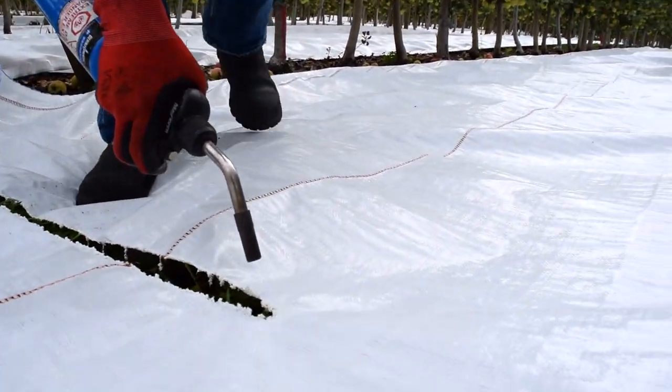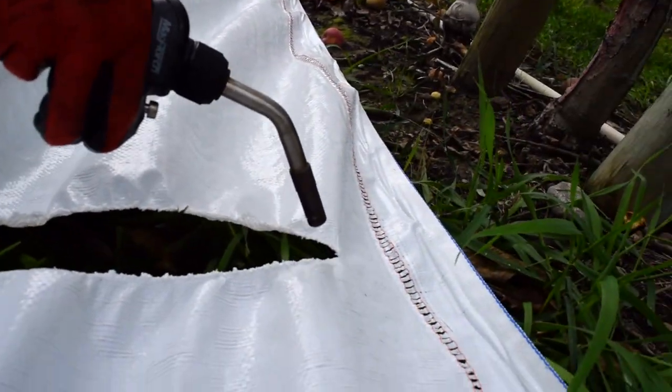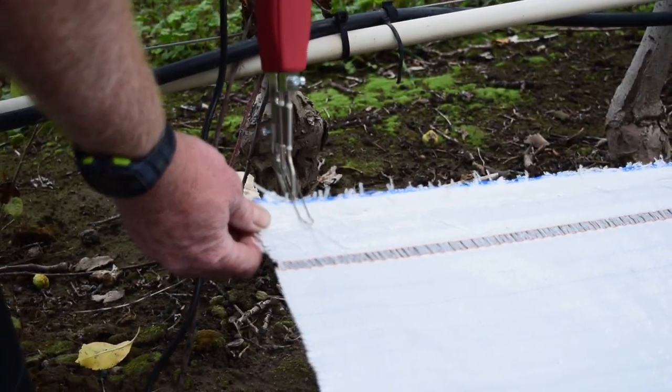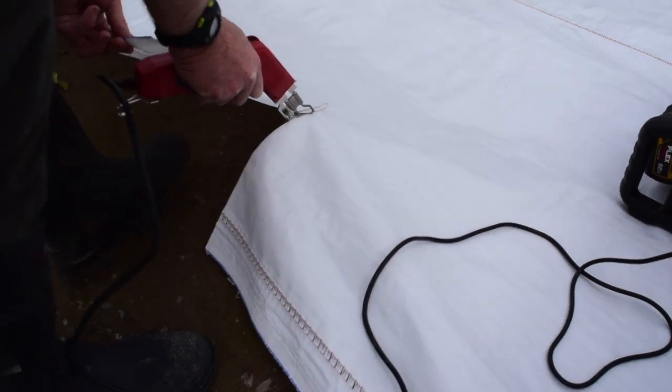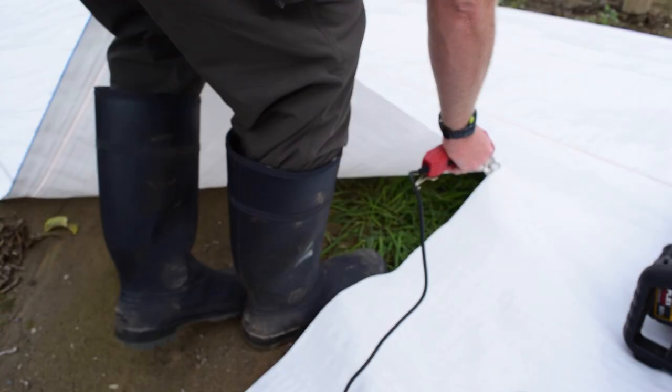Now that the tarp is pulled down the entire length of one row, it's time to cut the tarp. You can cut with a regular utility knife, but you'll have to singe the ends anyway, otherwise most tarps will start fraying almost immediately. I prefer to use a hand torch to cut the fabric as it singes the plastic weave at the same time and reduces a step. Another option is a hot knife, which also singes the edges. If using a torch, be careful not to light any dry grass or twigs on fire. Cut the tarp at least three or four feet back from the main road or edge of the adjacent row to give more room when using farm implements.